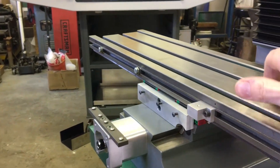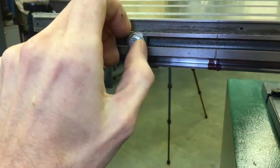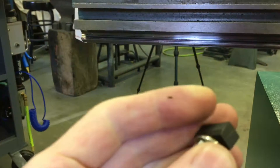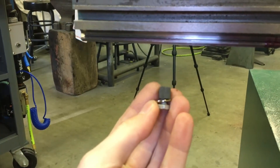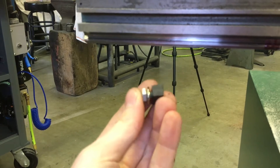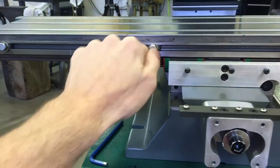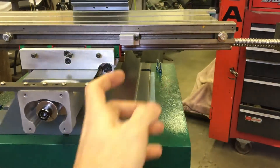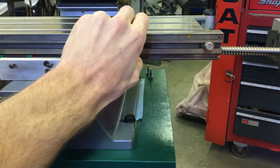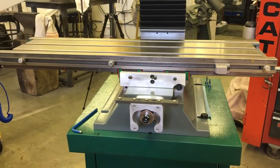It works, it's cool and smooth. These are little — they're not really T-nuts, they're just pieces of key stock. I nipped the end off so there was some draft to it and it slides in here. This is what holds the drip edge along there — one, two, three. And here's an adjustable X home switch.